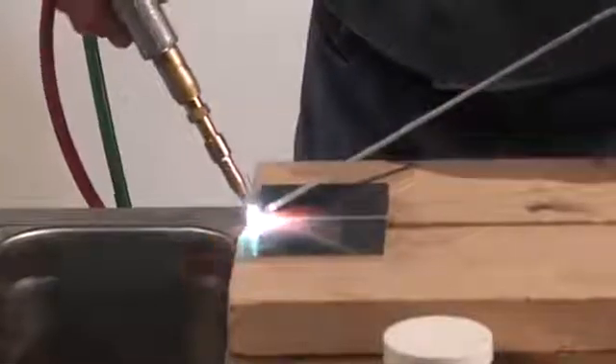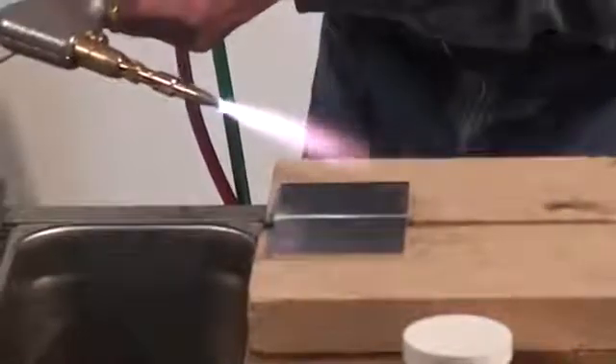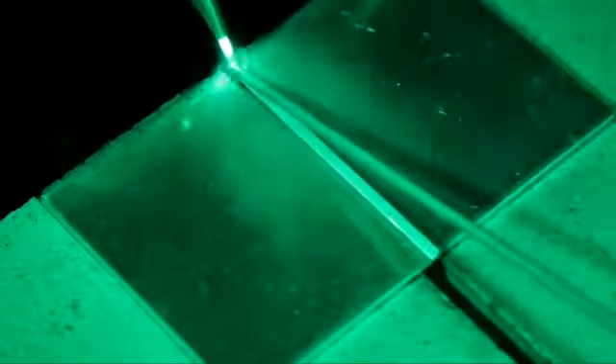Go down and wait for it to start to melt or wrinkle. Once it starts to melt and wrinkle, we're going to go back and make a smaller flame on it — just feather right here. Hold that torch just like you would a TIG torch. Take that cone down closer to the metal. We're going to get the aluminum where it's starting to wrinkle or melt, then push the rod in.